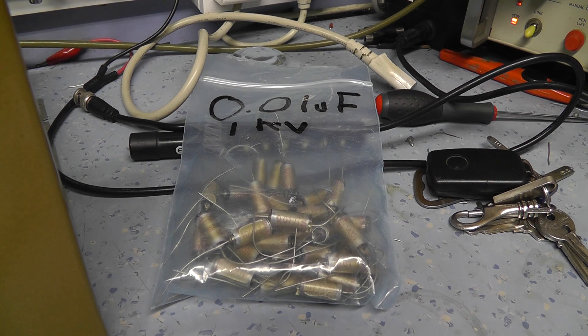Presently I'm in the middle of recapping a Chapman AM tuner — AM/mediumwave/shortwave tuner — and I've replaced a lot of the capacitors already. The paper capacitors that are inside, most of them were Hunts.